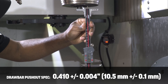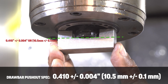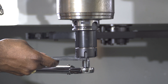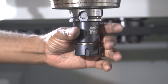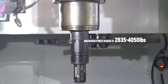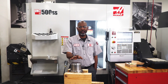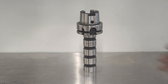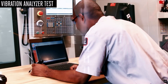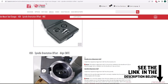Now we need to set the tool release push-out the same way we did in the six-month interval service. After setting the push-out to the correct value, install a hollow tool holder and use the collet wrench to hold the tool holder while you torque the set screw to 20 foot-pounds. Measure the drawbar force with a force gauge — the reading should be between 2,835 and 4,050 pounds. We recommend you check the spindle vibration: install a balanced tool holder rated G2.5 or higher into the spindle and run a spindle vibration analyzer to ensure the spindle passes the vibration test. Finally, set the spindle orientation — follow the directions in the description below.